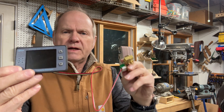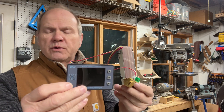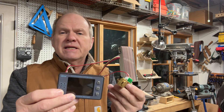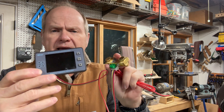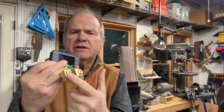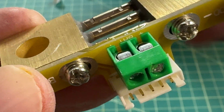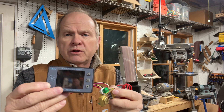The shunt measures the current, and the display shows the current going in or out of the battery. It does some nice calculations — ultimately giving you the percentage of charge left and calculating, based on the current load, how long the battery will last. In addition to the shunt and display, there's also a wire that goes to the positive lead. Since the shunt connects to the negative side of the battery, that wire completes the connection, providing the 12 volts to run the display and the little microcontroller inside.